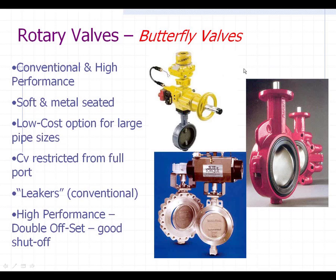They will definitely leak over a period of time because they scrape and scrape and scrape. They are low cost for large pipe sizes. If you're not already familiar with the high-performance version of these valves — which is down here at the bottom — these are a double offset, and the price on them is real good. They're easy to automate. Anything 8-inch and above, they do a very nice job. You can also do very nice control modulating with them because they put out an equal percentage flow characteristic inherently, so they can be used for modulating too.